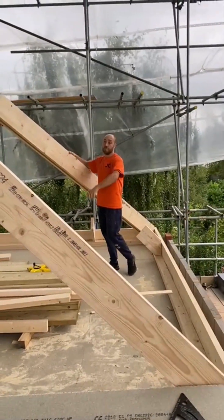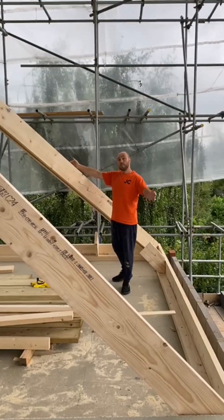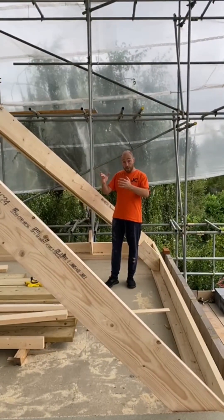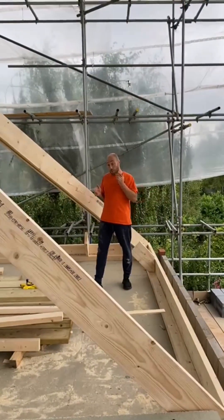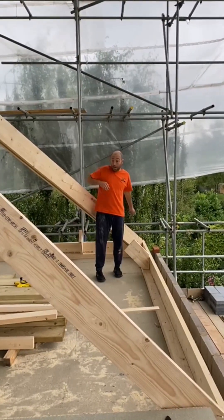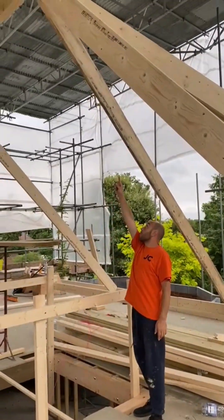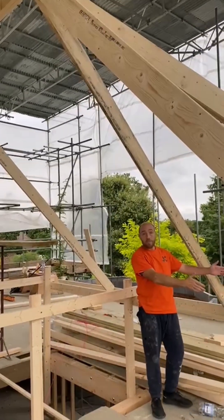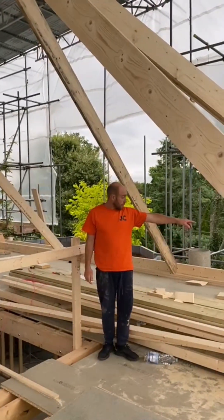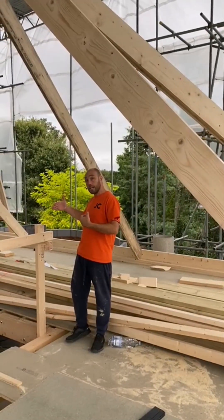Good work tips — doing the tabletop roof. There's a couple of good ways of working this out, but what I would do is find a right-hand corner and lay my rafter down. That way I can work out with my timbers exactly where my trimmers are — double plates, top and bottom — and the size of my stud walls. I can also, from that position, measure out from my seat cut, my bird's mouth, to where my plumb cut is going to be on my rafter, all from this corner. Once we've set this out on the floor, what I'm aiming to get is where the plumb cut comes down and touches the floor. Then I'll measure in from the corner, out from both corners, and do the same on the other end — and the distance in between is what the tabletop's going to be.